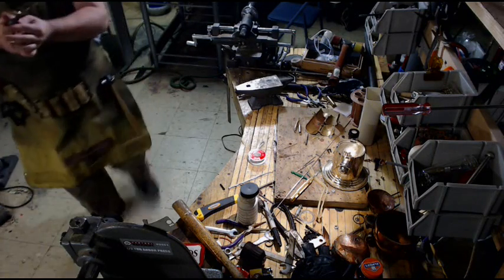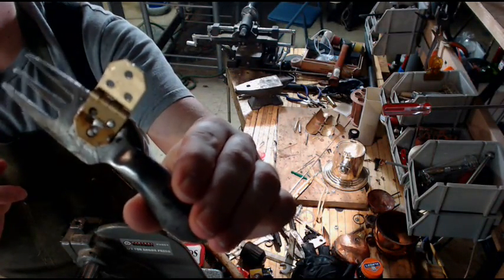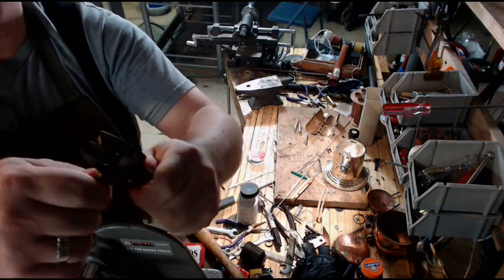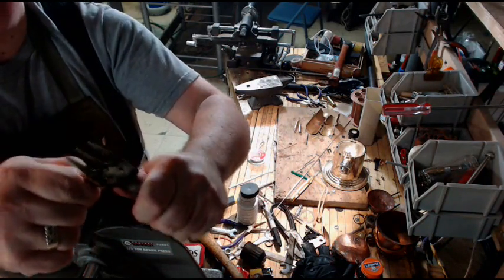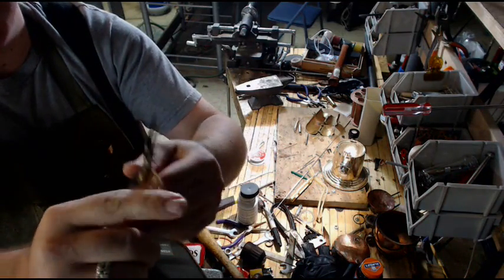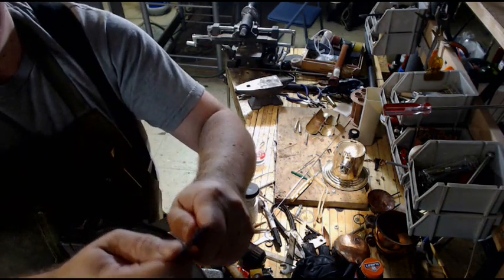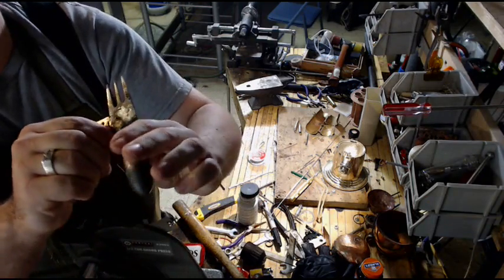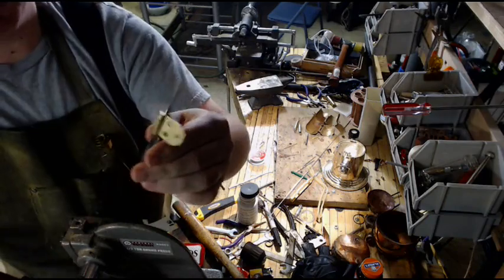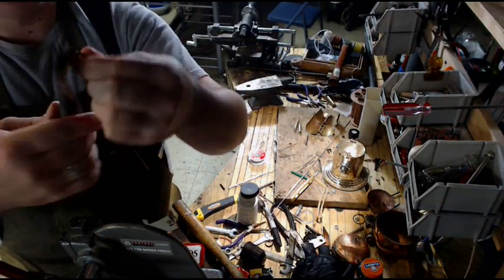And there we are. Now we have a brass hinge that has been soldered to a stainless steel cheese knife, which is just what we needed, right? Now this isn't melted in and like acting like glue. This is a metallurgical bond between the brass and the stainless steel. It's about as strong as you're going to get without brazing it. And with stainless steel, it's one of the best choices for joining two pieces of metal at all.